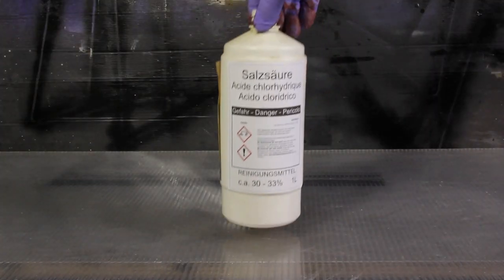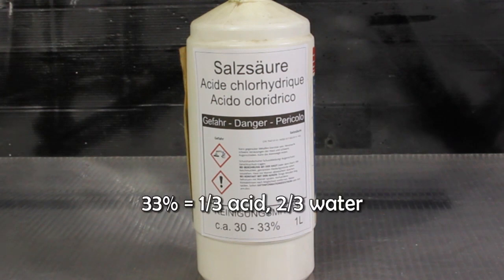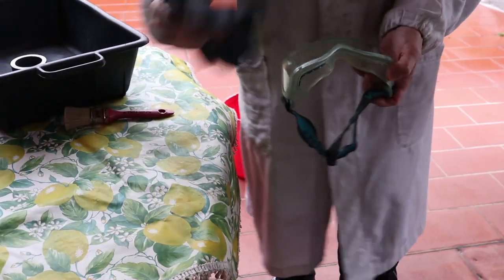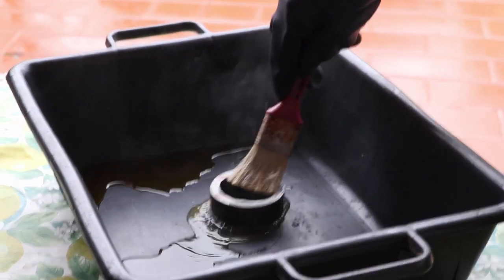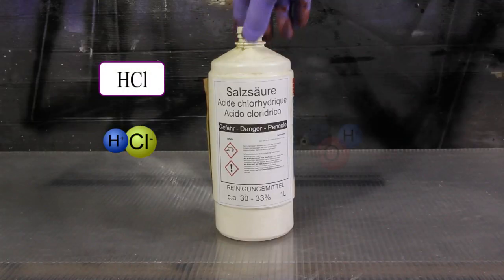For pickling I'm going to use hydrochloric acid. This is normally sold for household chores in bottles at a 33% concentration, which is more than enough for many jobs including pickling metals. A 33% concentration means the actual acid is one-third and the remainder is water. It can also be topped up with liquor from previous pickling. Goggles are mandatory because even this acid may cause blindness. Also this job must be done outdoors or in a well-ventilated area, and a fan would be useful to bring the fumes away.